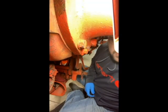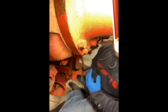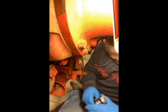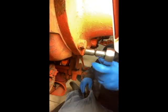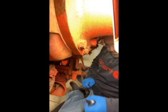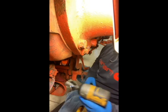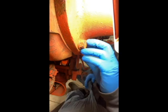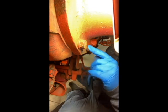Okay, so we're set up here underneath the tractor. There's our pin. We've got to take this little keeper out — that's a nine-sixteenths. Let's break it free with the ratchet first. All right, keeper's out of the way, so that gives you full access to your pin.